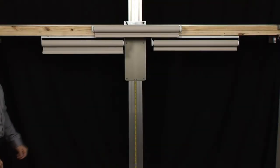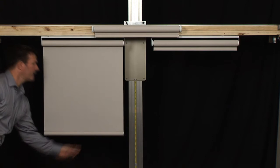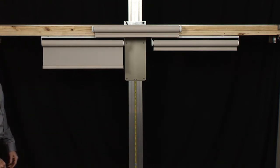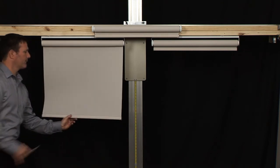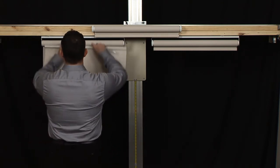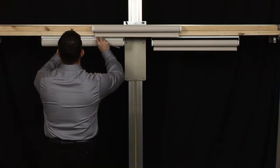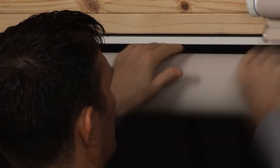An alternative method to adjust tension does not require the use of a flathead screwdriver, but instead requires the use of our fabric-wrapped bottom rail. The design of our bottom rail allows it to fit between the tube and the head rail. If the tension is too loose, simply lower the shade and feed the bottom rail through the opening between the tube and the head rail, rolling the fabric onto the tube. This can be repeated until the proper tension has been reached.